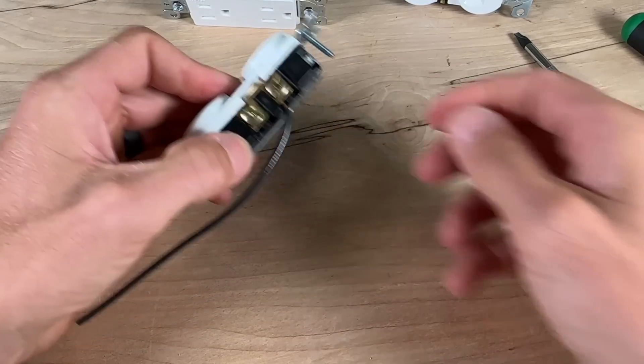Now let's look at those new options — the future of wiring these devices. The Leviton Decora Edge incorporates levers instead of screw terminals. You pass the wire in similarly to backstabbing, but the lever closes and does a much better job at securing the wire within the outlet. Done right, you have no exposed screw terminals and no exposed copper on any conductors. It's a super slick design.